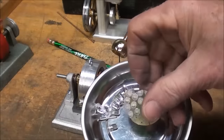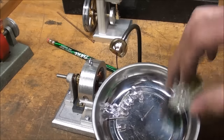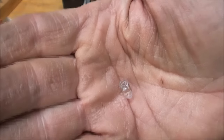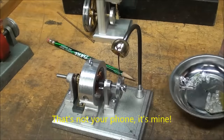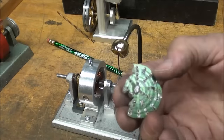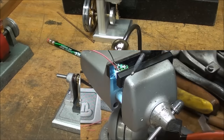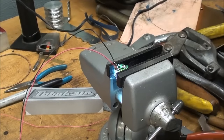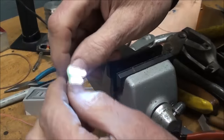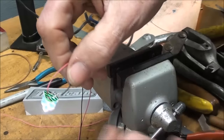These LEDs came out of a cheap flashlight — they're so plentiful now, and it's easy to unsolder them and take them off. They are very tiny, hard to handle, and hard to solder. So what I did here is I cut these off in clusters off of this little circuit board, and I'm going to put either two or three up here into the shade. I had to do a bit of rather delicate soldering onto the back of these LEDs to connect some of the diodes with the others, but now I have a little cluster that is ready to mount into the lamp post.